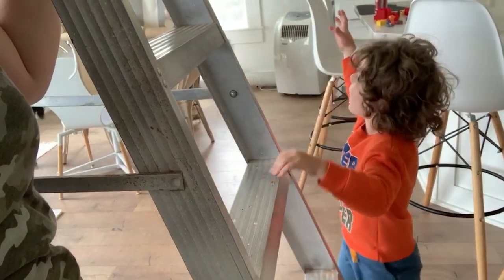So it's going to be super simple. We are moving over to the next stud over, coming this way into our living room. We are getting a new swing. We're going to be cutting a 10 by 2 board — so 10 inches by 2 inches — cutting it to the length that we want, and then just getting the rope. Make sure you're drilling into a stud in your ceiling, or else this is just going to fall out and you will be so disappointed. You want to make sure you're getting it into a stud with the proper hardware that will hold the weight limit you're hoping for.